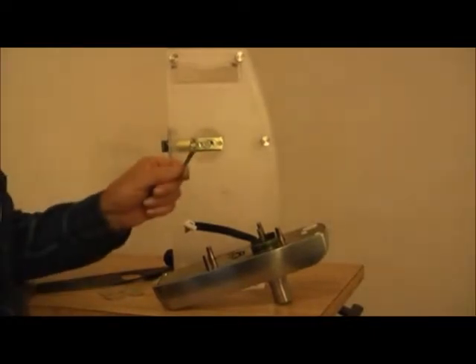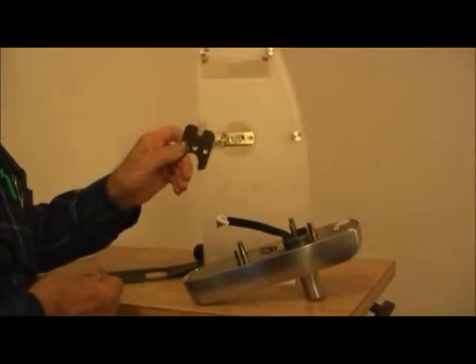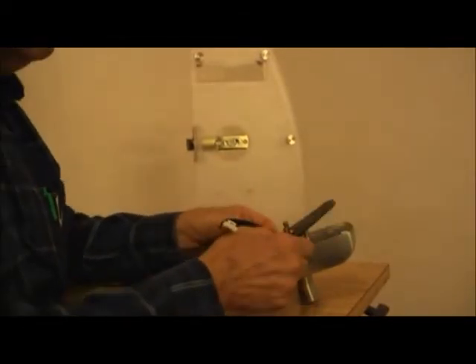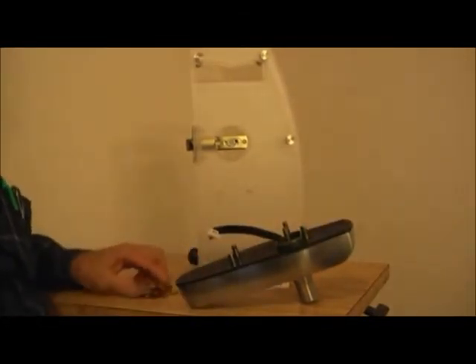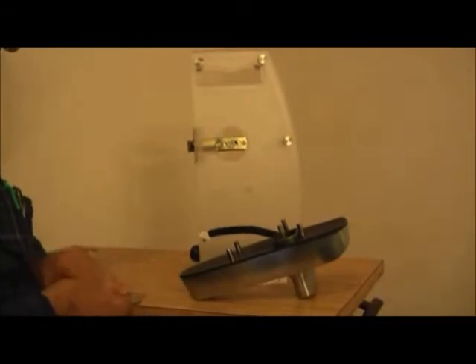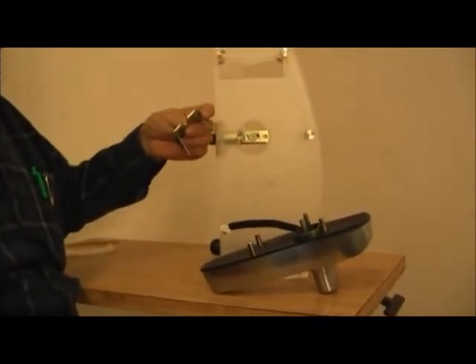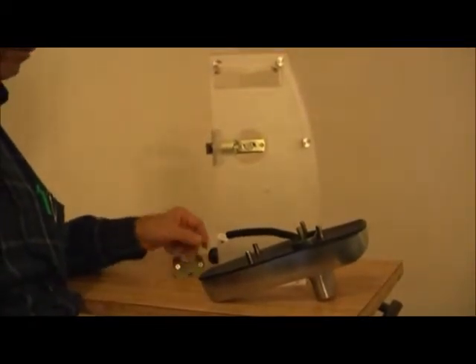For this step, we're going to use two of the short machine screws. There are five machine screws used for mounting the lock — we're going to use the two shorter ones. We're also going to use the fixing plate and the rubber grommet. We start by placing the rubber grommet snugly on the lock — you want the ledge of the rubber grommet to face towards the lock for a nice snug fit. You then place the two screws into the fixing plate. Note that these are breakaway screws for different depth doors.